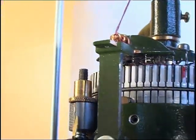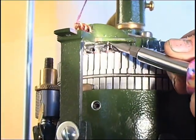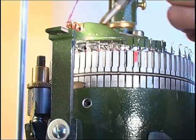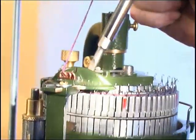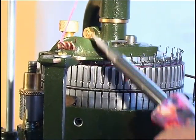And that's not too bad. So the rule is, the needles — you should just be able to put a piece of cardboard in between them. And the same applies for the needles on the cylinder. The guide needs to be fairly close to those as well, but not touching them, or the latches will catch in the guide.